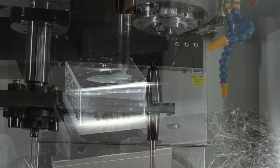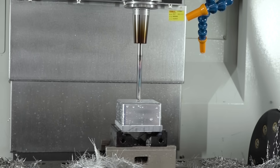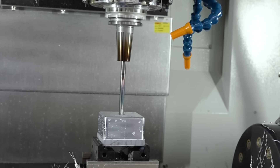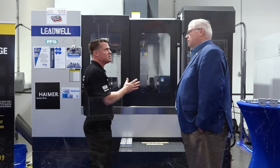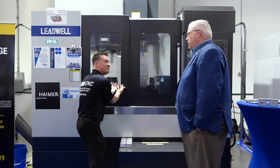You have described so many conversations I've had, Gerald. When I speak to the audience and go into the machine shops, the number one complaint — knowing that they need to do more than just three axes — is how much Z axis they lose when they pop a trunnion on there. And vice versa, they know that they need it, so if I'm forward-thinking enough, then this is the answer, because I know I'm gonna need it. Absolutely, and we designed the machine with a taller column to help compensate for that extra clearance height.